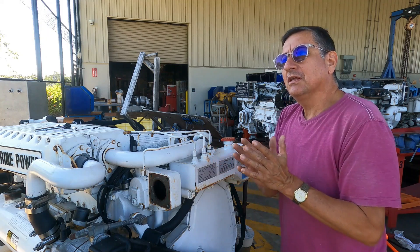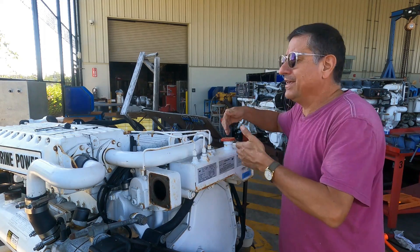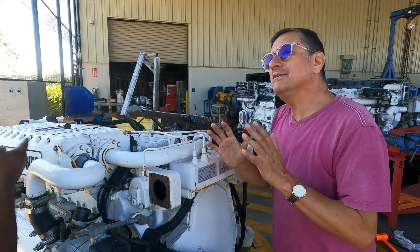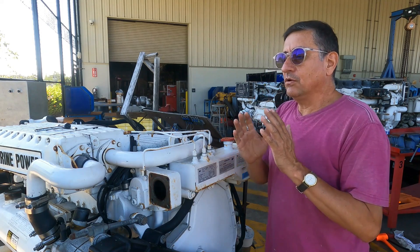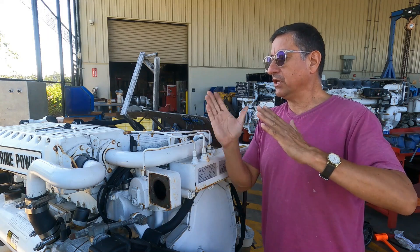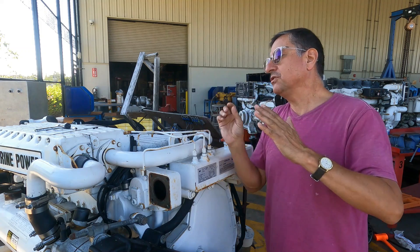This is the situation. Of course, if you have overheating, you need to replace this and this and all of those items. But first you check them. This is for prevention. Don't forget, Captain — you need to always verify both gauges. Starboard engine and port engine should be equal. And you need to be familiarized with the position — your normal running temperature.